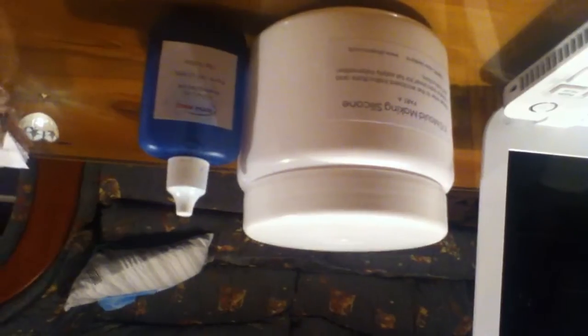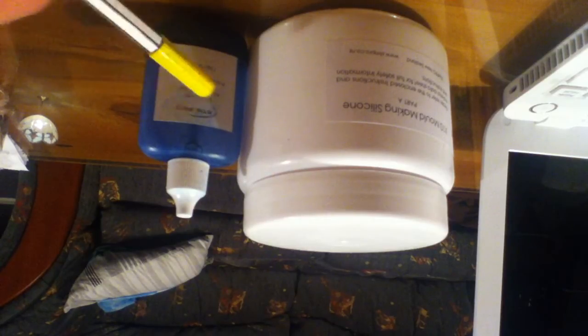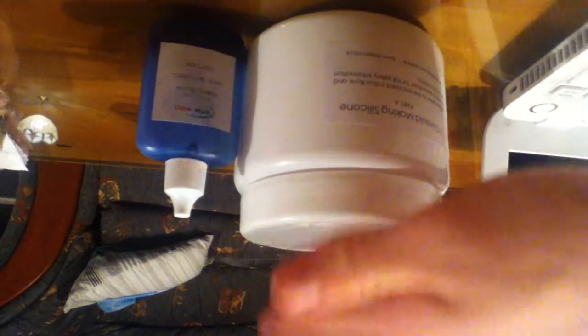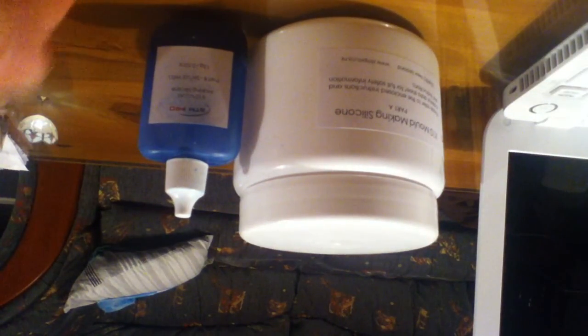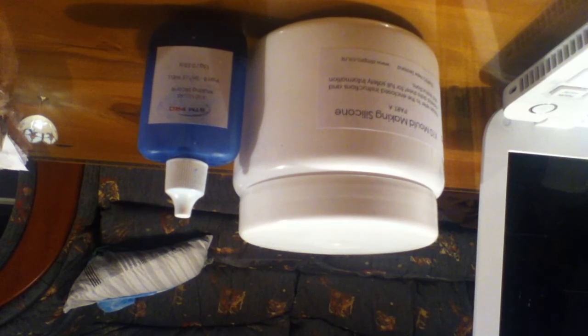Last but not least is easily the best one, and this is a bit harder to find. This is a silicone — quite hard to find this stuff. I only found it in my country, New Zealand, because my flatmate works for this company. I was originally going to buy it from STM Pro, but the problem was they only had silicone batches in large amounts — $300 for 5kg, which is just unrealistic. I tracked this down and it only cost me $40. You've got the silicone here, which is a liquid, and the catalyst here, which is also a liquid. You add 100 parts silicone to two parts catalyst, so you're going to need scales and mixing equipment. You combine the two and in 24 hours this will set into a silicone putty.